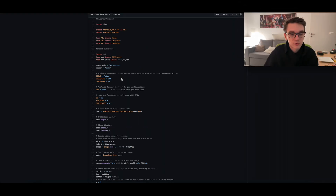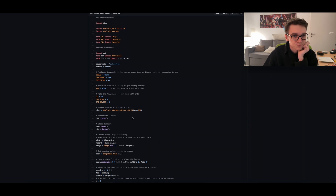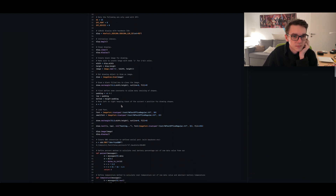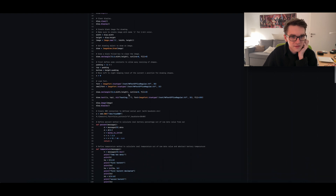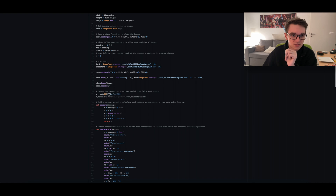The Pi writes only to a cache which is lost on reboot. This whole script is run as a service on boot — the service starts automatically and goes through the opening bit: initializes the display, initializes some variables, and loads the fonts needed for the display, which are pretty similar to the fonts used in the car itself. I also define the serial device, which is the OBD dongle — you might have to adjust this depending on what hardware you use.